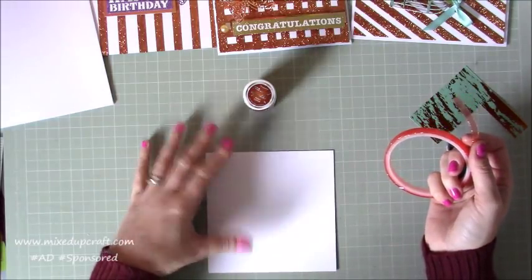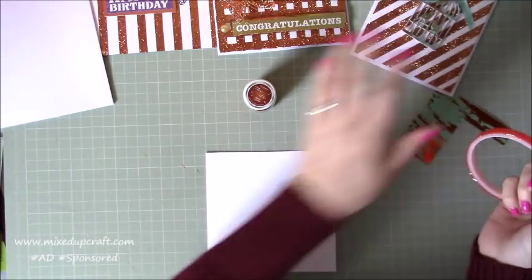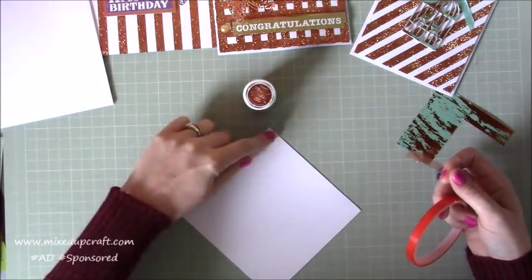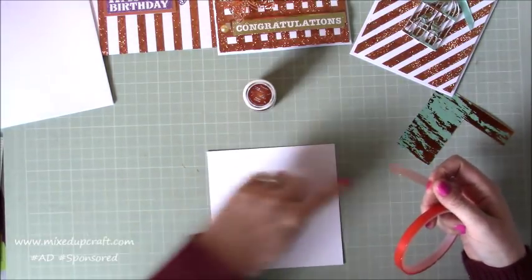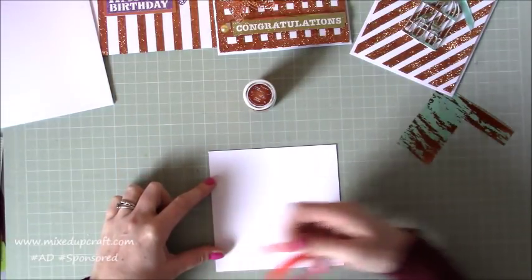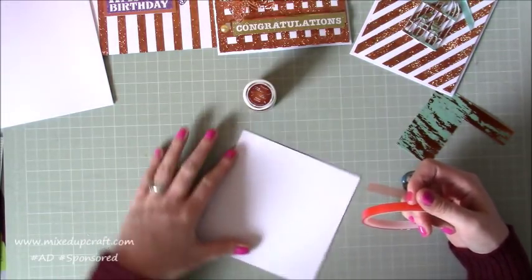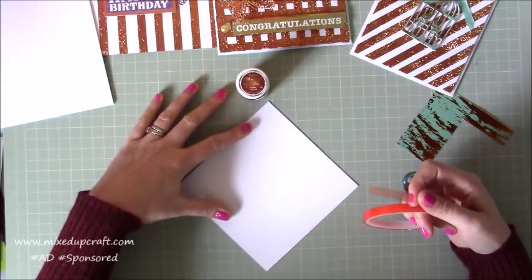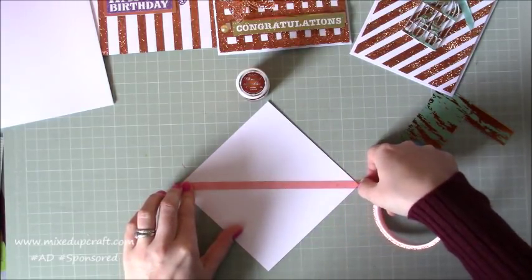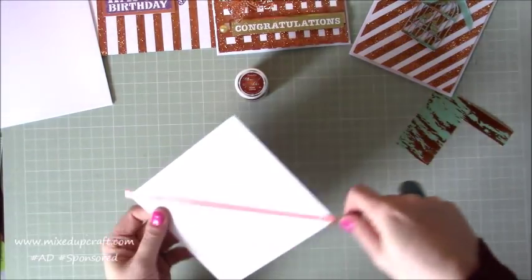For this one I'm going to do the design crisscross, so I'll do it twice. I'll just show you how you start off. On the angle, put it on the side. If you're just doing normal horizontal or vertical stripes, start from the top, put one through the middle and one at the bottom, then the middle of that and so on - that way you know you're getting equal gaps. This time I'm going to put this on the side, and once you've done this middle piece your tape will be at the right angle.